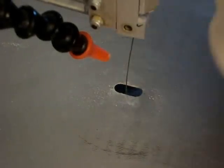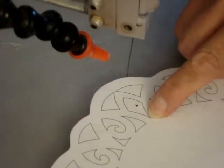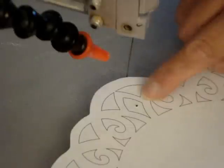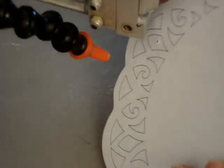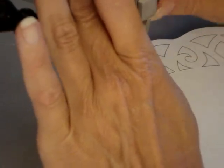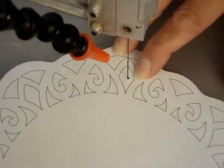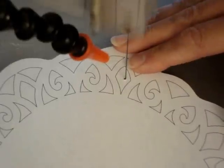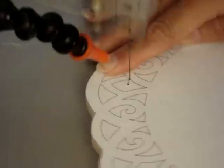The next segment we're going to do is this really sharp corner — these are of two angles and they're each done a little differently. I think I showed you how to do that in the second set of diagrams on Lesson 7. So I'm going to thread my blade. This time I'm going to enter at the obtuse angle — I'm just going to go to the edge and pivot it.